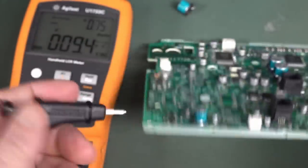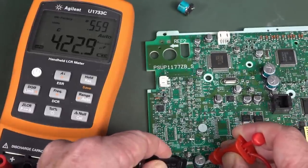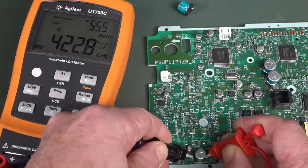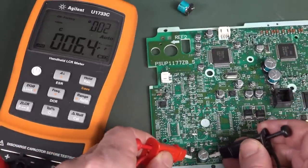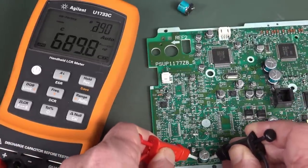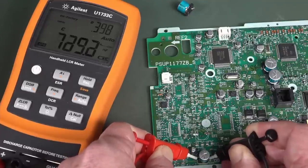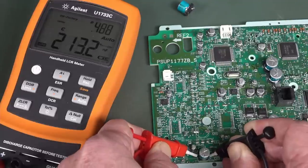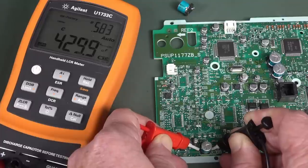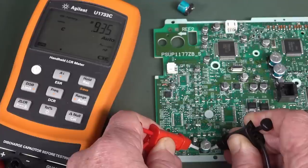Let's measure a 470 microfarad cap in circuit. At 100 hertz in fixed capacitance mode: 422 microfarads. One extra trick when measuring in circuit: not only manually select the capacitance mode, but also swap the leads. With the leads swapped, it's showing only 690 nanofarads — that residual charge or polarity reversal is causing an issue. You may need to let it settle.